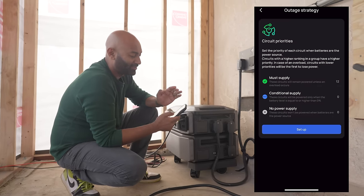We need lighting in here and all that stuff will be one new circuit. The second new circuit we'll already need is a heat pump water heater, which we think will go around here, I think, or in the corner. We're not really sure just yet. Sound off in the comments if you have any ideas. Currently, like we mentioned, it's just all wrong. We've got to do a lot of new plumbing and change all that and fix it. With our system, we have the one inverter, which means 7.2 kilowatts of output, which will be more than enough for everything that we do in here. We're building a net zero building, which means all heat pumps, lower power consumption, water tanks, no instant stuff. We're going to be just fine.